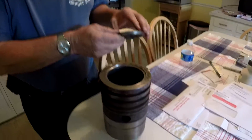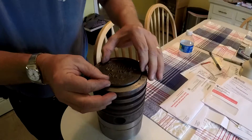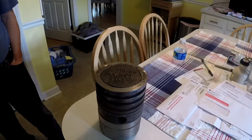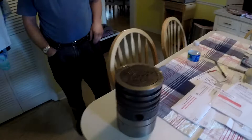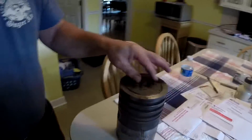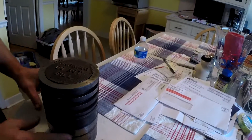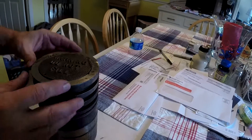We're back — he parted off the little cap that we were making and it fits right down in the top of the piston like we were hoping. It's a careful tight fit — almost there — there you go. Now we just have to throw it in the oven to keep the cast iron warm before we weld it. This piston has seen better days with the marring right there from when it was beaten out of the block. He also beat on the other end to drive it back and forth, so I had to turn the bottom of the piston down because it had mushroomed. It's back to uniform size and it does fit in the bore.